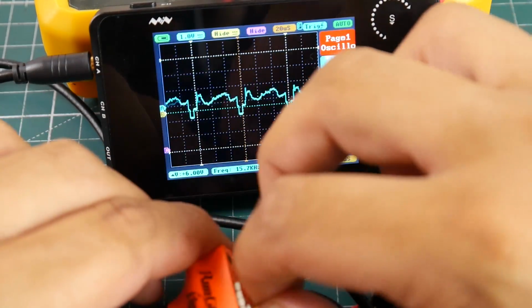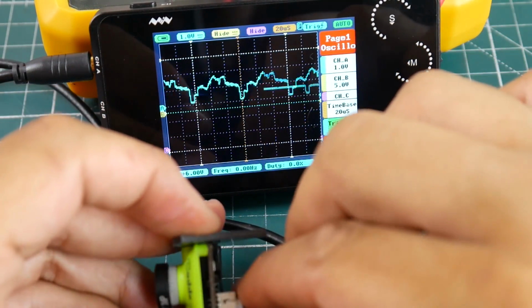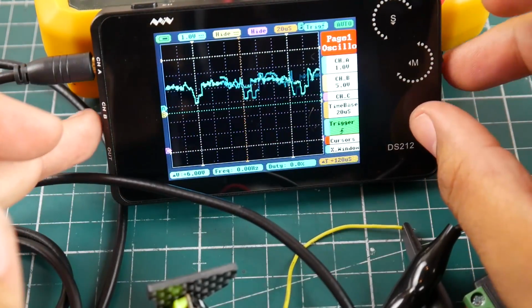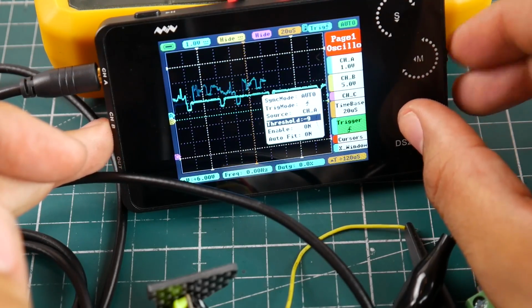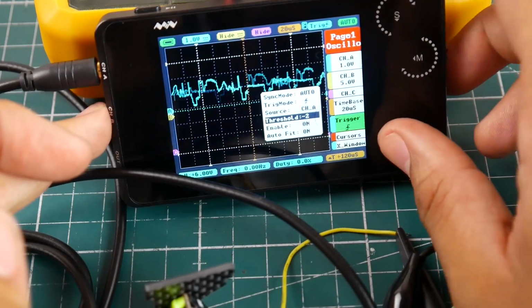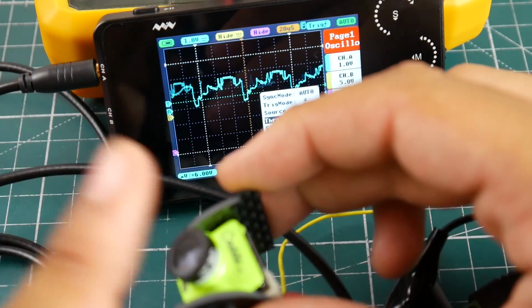So yeah. And if you guys are unsure, let's go ahead and grab the micro camera, which is the CMOS rolling shutter camera, which is the CADX here. And again, you see the signal is messed up. You just have to play with the threshold there. So we're going to go to trigger again, and we're going to go to the threshold, and we're going to just move that dotted line towards the signal until it equalizes really nicely. So there we go. It's really nice. And the camera's perfect. It's running perfect.